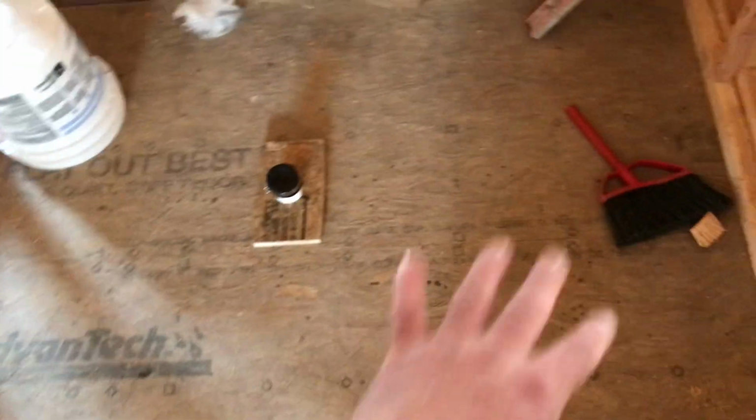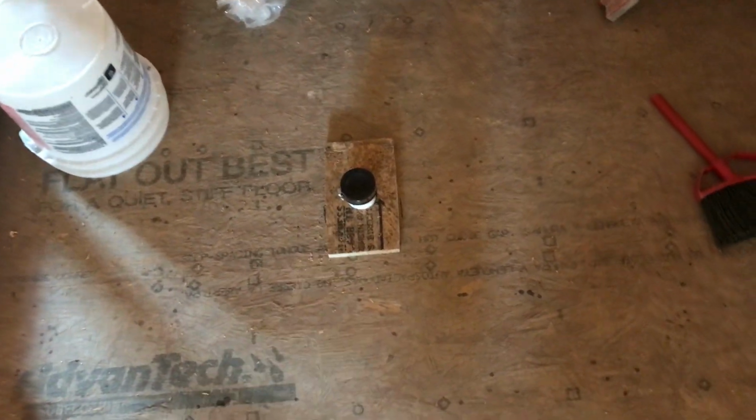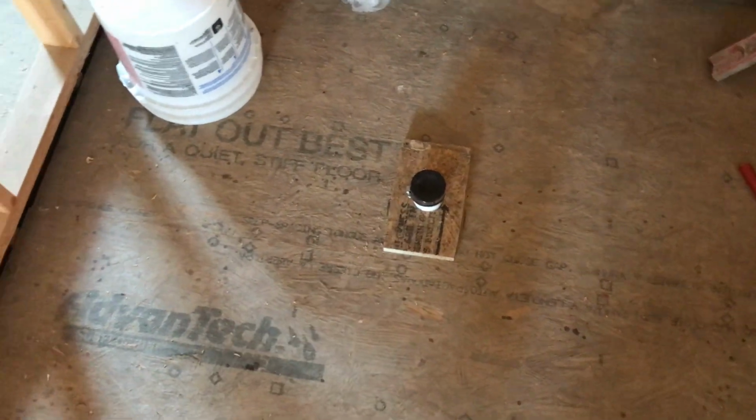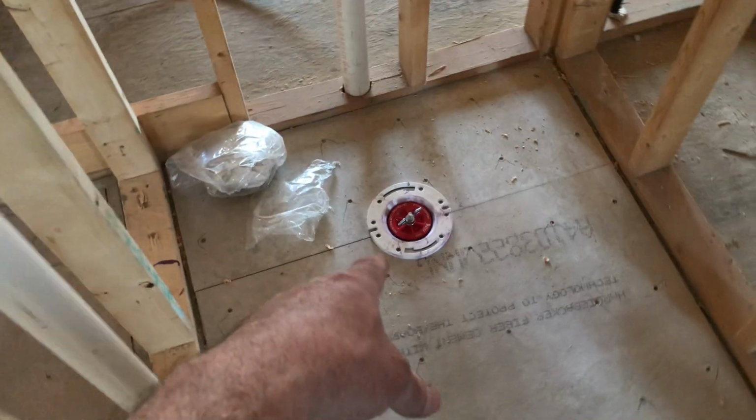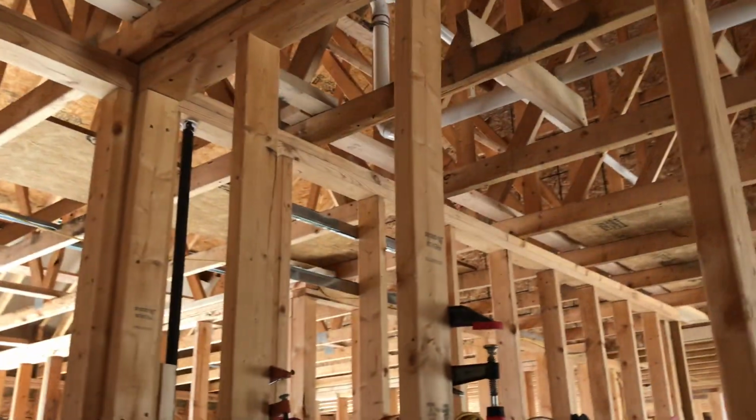Cap. This is going to be an actual homemade shower pan, so we kind of knew where we wanted to put it. It's basically in the center of the shower. Rubber cap. And plug, test plug. So what that does, it basically makes it to where if I fill water in from way up there, this will all just fill with water. We'll be able to test this out.